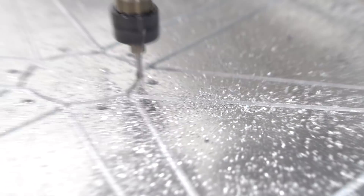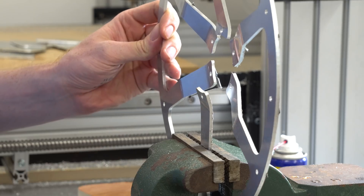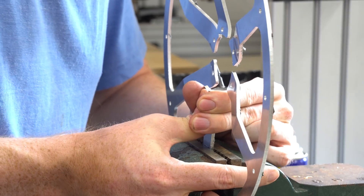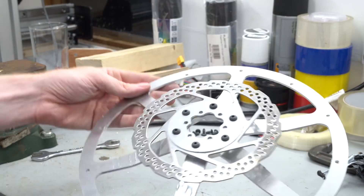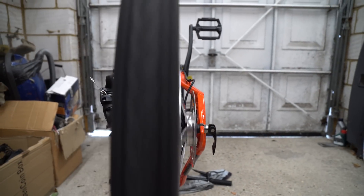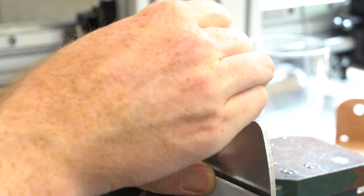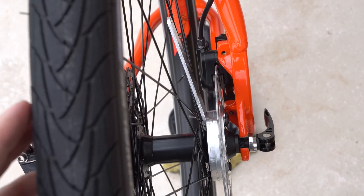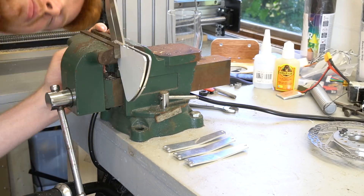Essentially I wanted to cut the outer ring of the pulley and its spokes in one piece, then bend the pulley spokes so it would avoid the brake caliper. But it proved to be quite difficult to evenly bend the spokes to the correct same angle. The mounting of the pulley works well with the clamping solution through the disc with two 6mm spacers, but when mounted on the bike it didn't run very true due to the poorly bent spokes. The final solution was to cut the spokes individually, allowing me to prototype just one and bend it until it fit the wheel properly, then repeat the process another five more times to have a relatively straight pulley.